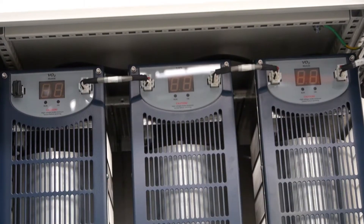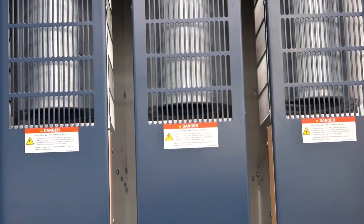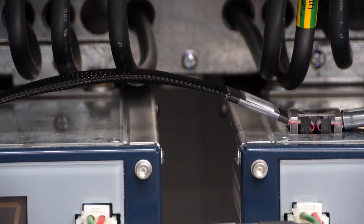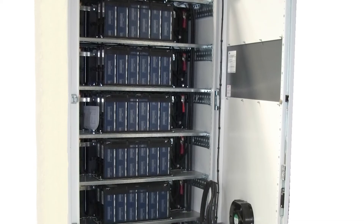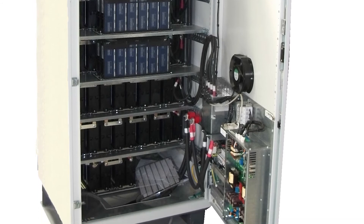The inverters form a redundant modular system that supplies power to the load during power quality events and also recharges the PCS100 UPSI's batteries or capacitors. The capacitors are an example of storage used, providing a 15-year lifespan and proving very reliable in the field.